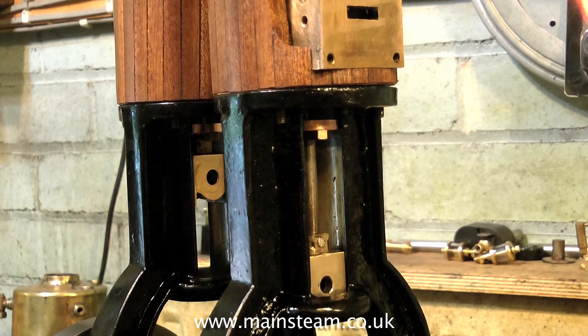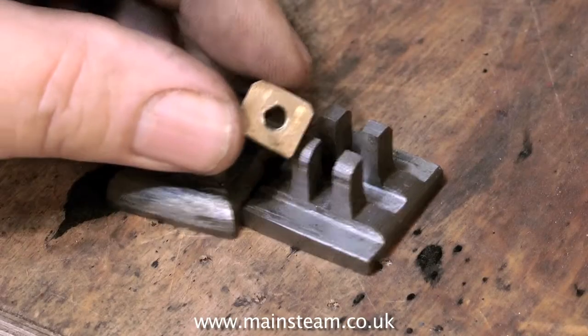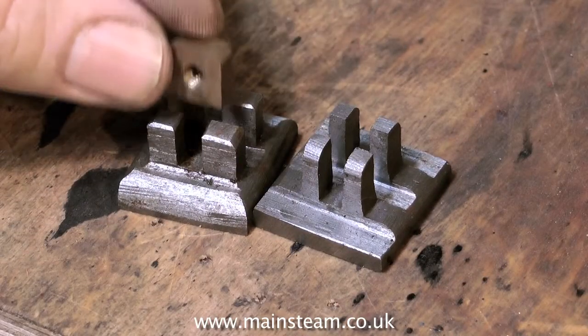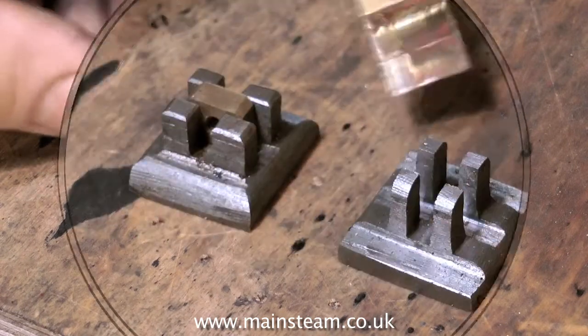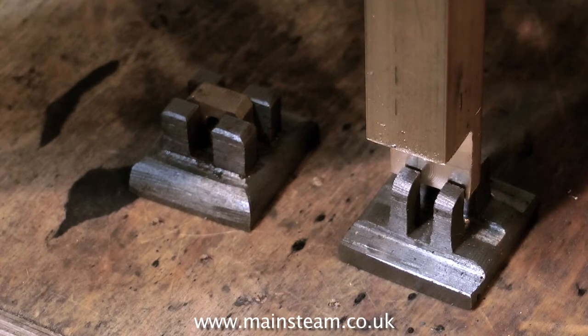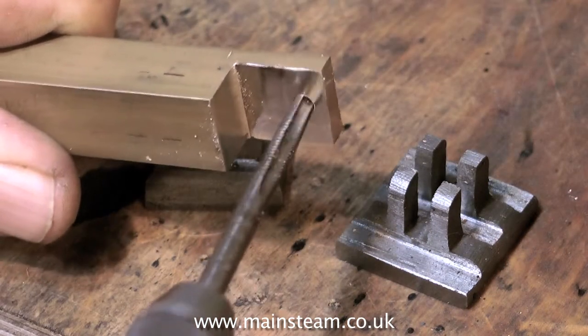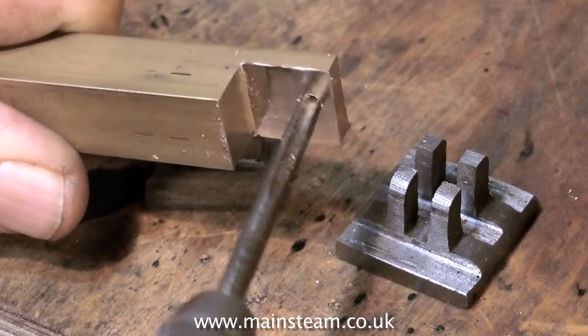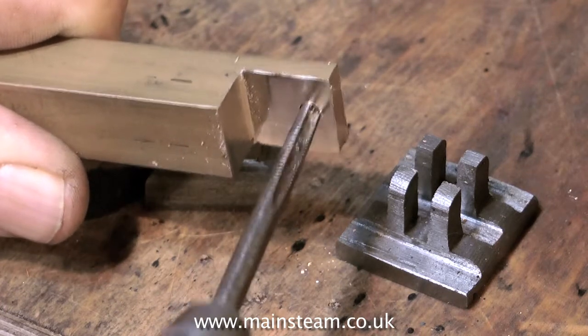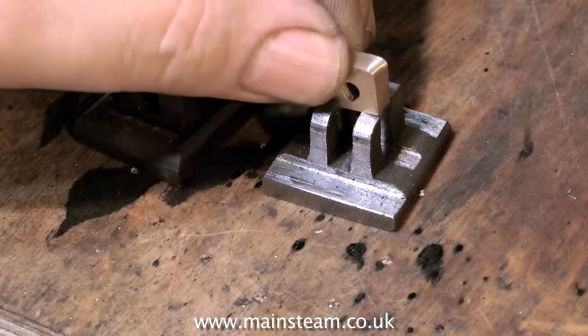One final little job and a handy tip is to do with the slide valves. There is only one of these with this engine. This is a small brass part that screws onto the valve spindle; it allows adjustment of the valve and also moves the valve up and down. So I had to make one — a very simple job: machine a piece of brass, drill a hole in it, tap it 2BA, cut it to size and shape it. This will do the trick.